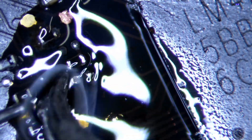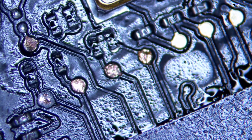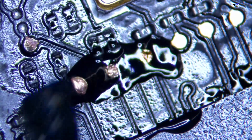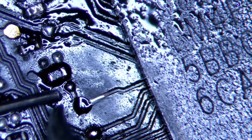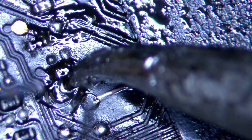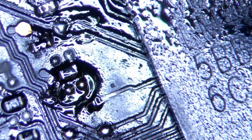We did have to remove this resistor and we need to replace it with another one. We're going to clean it a little bit better and make sure there's no dirt or debris. On this other side, it's giving the same type of situation - you can see all three on the left look good, that's what it's supposed to look like. We're going to do the same thing here, touch up a lot of stuff, use some solder to help clean, and use a hot iron. We want to make sure these pads are good when we put the resistor back so they have nice connectivity. Now we're going to be putting back the resistor.